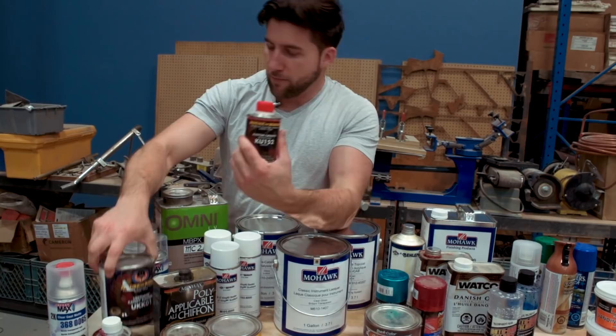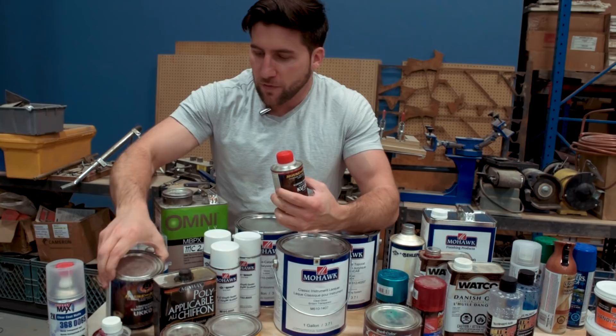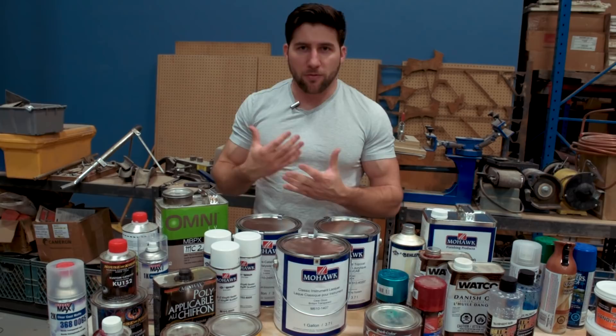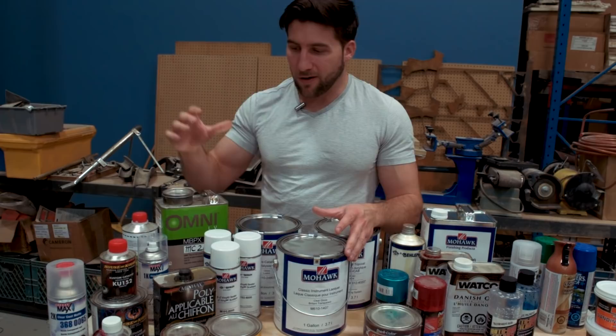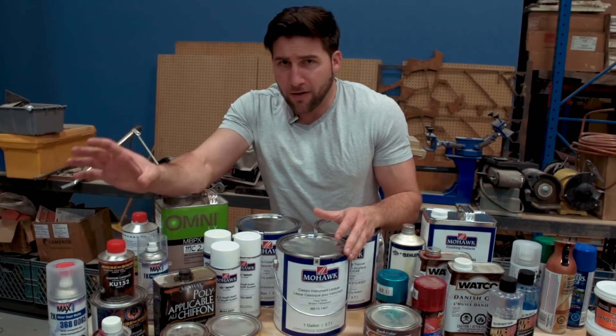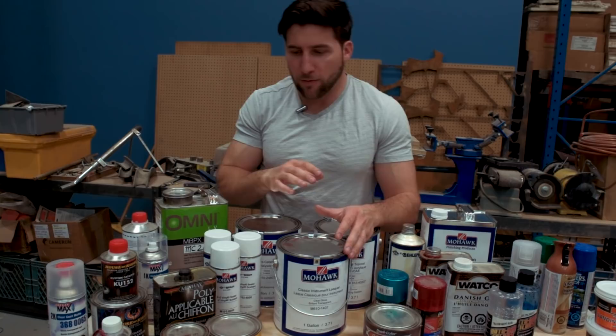On the note of automotive finishes — you can use that over a urethane because it's a polyurethane. Products like House of Color give you some insane, super vibrant show-car colors, and they've got better light-fast properties, protecting against UV a lot better than lacquers do, because they're designed to be outside on a car or in a show car room. It's just a higher-quality finish, really. But again, harder to work with, more expensive, harder to get your hands on. Not as easy for beginners, but when you've been doing it for a long time, it offers options you don't see in lacquers, oils, and that sort of thing.